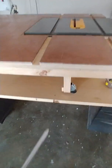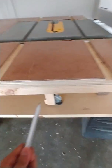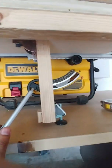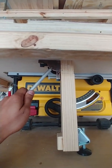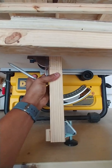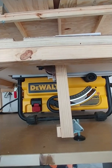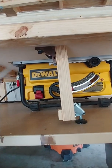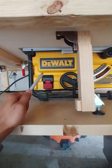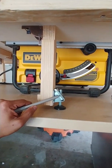What I needed was an infeed/outfeed table that I could also fold and put away. So I added these legs, which are about 11 inches in height, and I added these locks called posi-locks — you can Google 'posi-lock folding leg brackets.' Basically you press a button and the leg folds up flush with the underside of the table, so you can fold all four legs and put the table away.